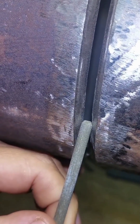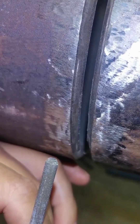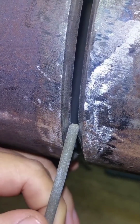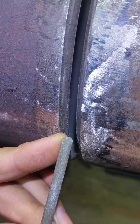Slight shake to turn off the arc. After the arc is turned off, be sure to watch until the molten iron is almost solidified, then press to the position of the keyhole — press to the root. That is the end of the electrode. One third presses the molten iron.